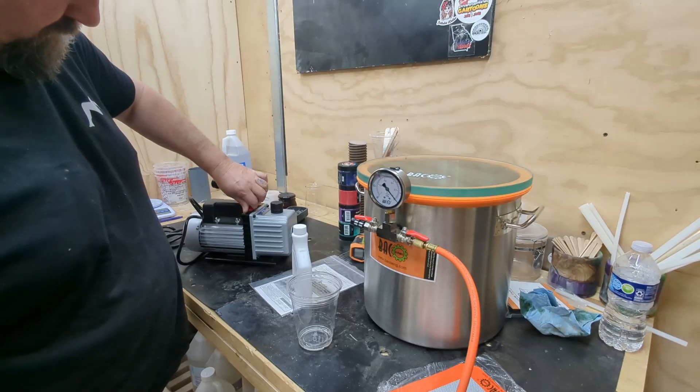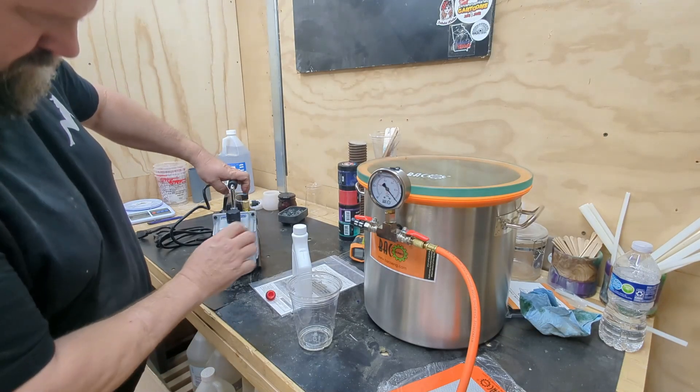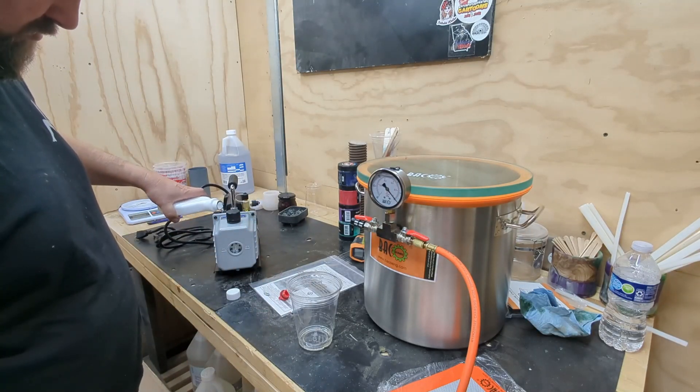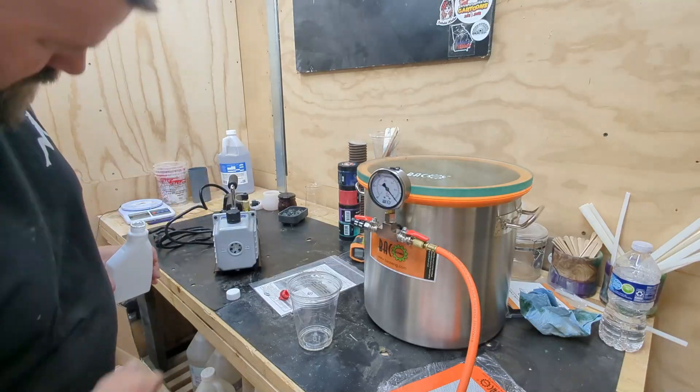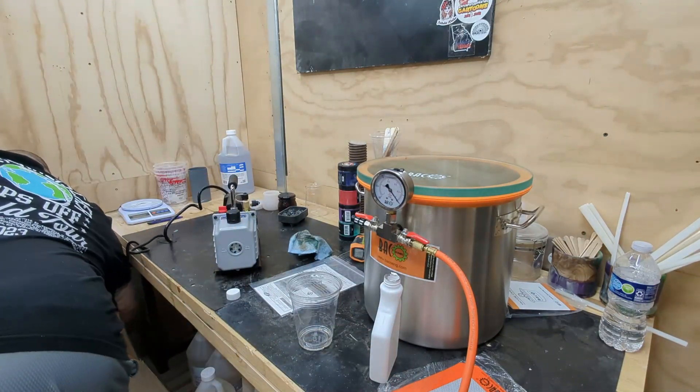Pittsburgh has set you up where it already comes pre-measured, ready to go inside the pump. Remove the red oil cap so that you can fill the oil into the pump until it gets to the point where it's in between the min and max line. Once you've got it filled up, clean up any extra oil on the edges and put the cap back on.